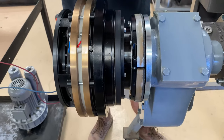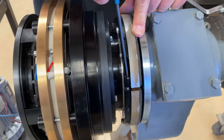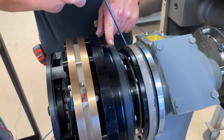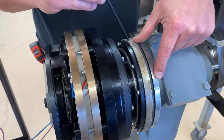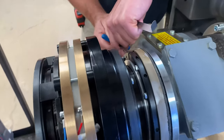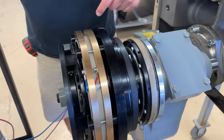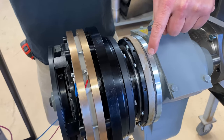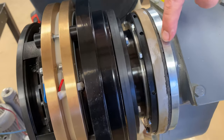To adjust the brake, you need to energize the clutch — put power to the clutch — and we're going to loosen this up and thread it out towards the fixed plate until we acquire our 1.2 millimeter gap in the armature gap. So I'm going to de-energize the clutch. And this plate still isn't even hitting — the brake plate's not even hitting the fixed plate.